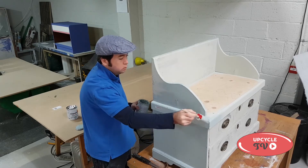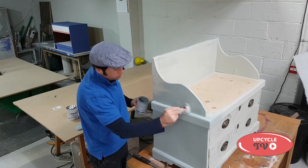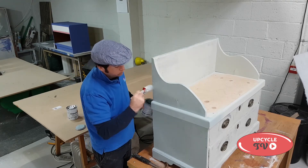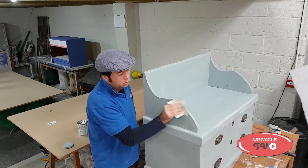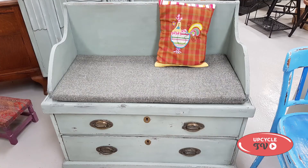I'm using a lovely chalk paint called Frenchique, which I absolutely love. The colour was Wedgwood Green — a lovely light pale green, as you can imagine Wedgwood would be. After finishing painting it, I did a little distressing with some light sandpaper, then went over with a grey defining wax to finish it off.